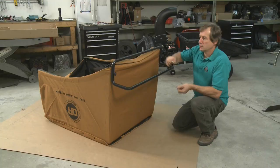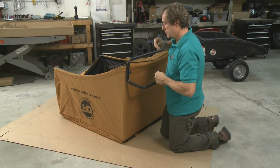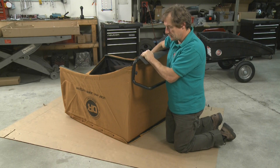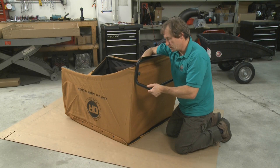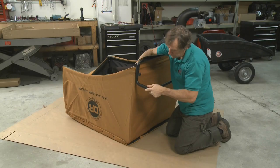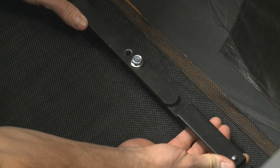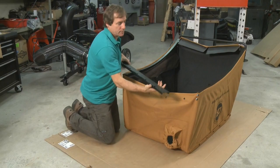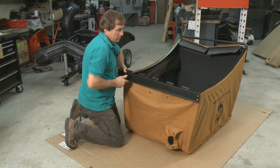Next we'll install the lower C-head bolts in the tube handle. The link assembly being latched will hold the tubes of the tube frames in line with the handle better. You can also rack the collector assembly back and forth until the holes align for the lower bolt. Secure it with a knob, leave it loose at this point. Now installing the hinge on the front — first unlatch the link assembly to take tension out of the collector. Insert one side onto the corner bolts, then push on the hinge and pull on the collector to line up the other side.